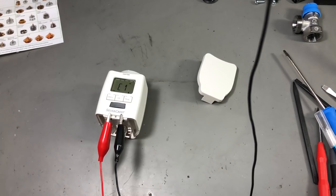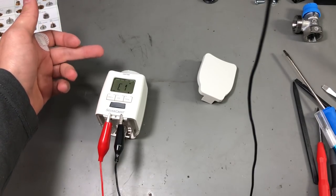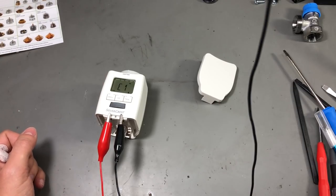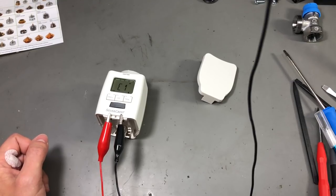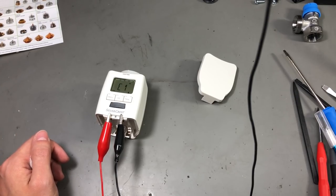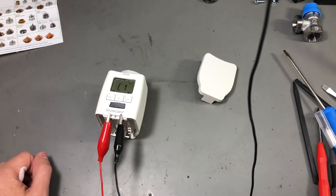One last thing I'd like to mention is power consumption. I couldn't have it installed on a valve to check the actual standby current, but I would assume this error mode is pretty equivalent to normal standby. While in standby, I'm measuring about 27 microamps. While adjusting the valve through the motor, it's pulling about 65 milliamps, and a full adjustment takes about 10 seconds. Considering these values you could calculate the battery life, though it would depend on how many adjustments your particular setup requires. I think it's a pretty low power usage and, considering the two AA batteries, a well-optimized system.